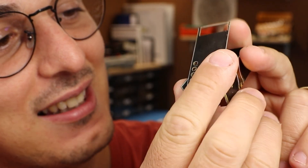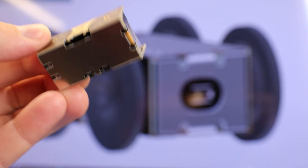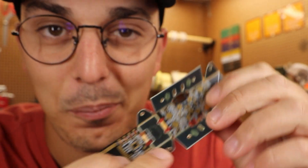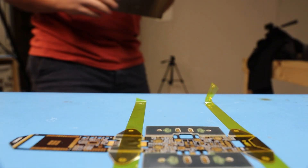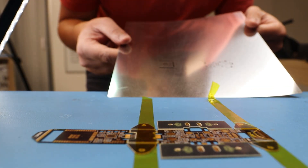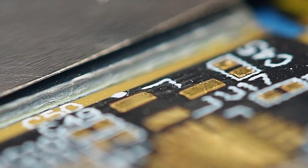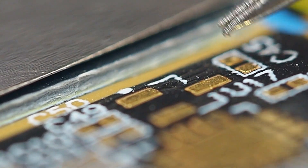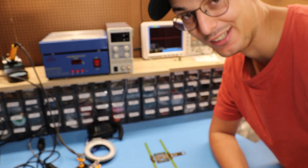It seems that the folding is going to work. It looked way bigger on screen, so let's open this thing up and start soldering it. I have a problem — these top-sided stiffeners are going to create a large gap between the stencil and the actual PCB, so it kind of cannot be soldered using a stencil. I'm just going to cut it with scissors.